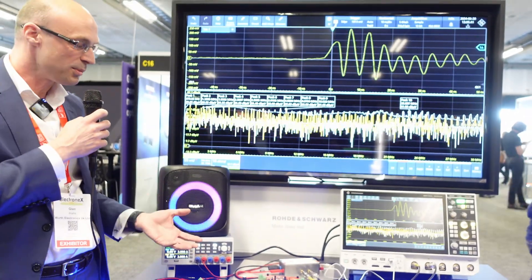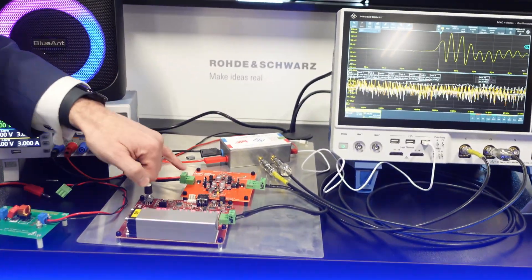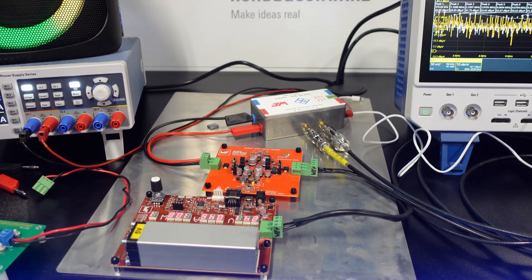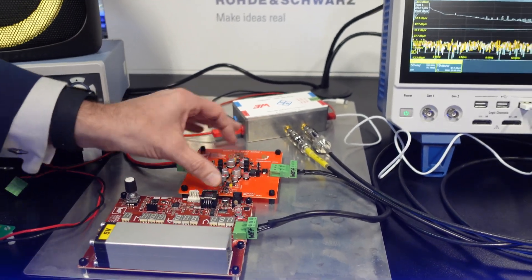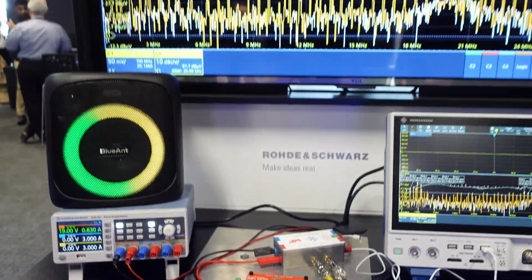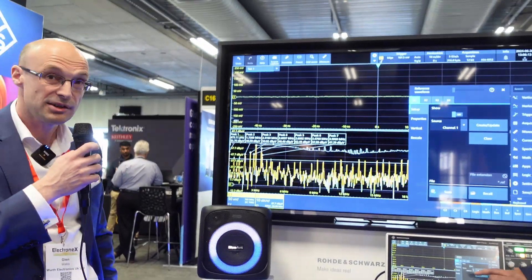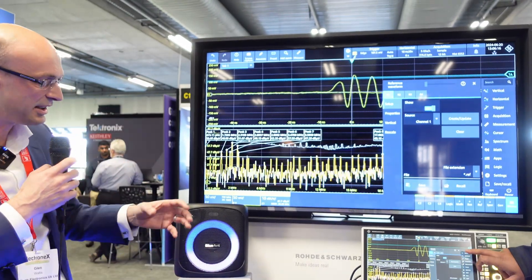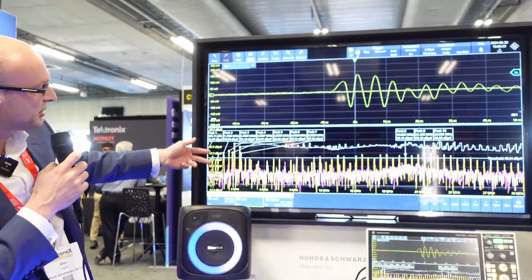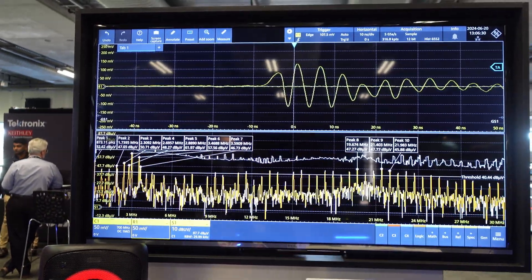What I want to do now is implement what a good design looks like. We've got a second circuit on the board that I'll now switch in, with improvements to things like common mode chokes, differential mode filtering, and better layout. Let me power this down, switch it over to the good design, and power back up. If you now look on the screen we can see that in the time domain we have virtually suppressed all that noise from the bad design. The conducted emissions have significantly dropped — we've probably dropped it by about 20 to 30 dB at certain frequencies.